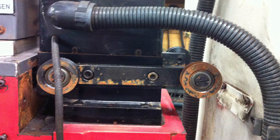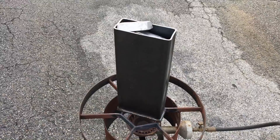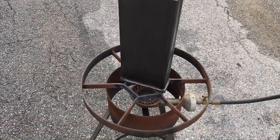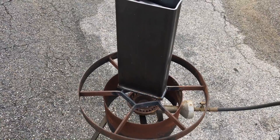Now the pulleys are in place that the chains are supposed to ride over, so that's still there. I did a bit of research and determined that the original counterweight was supposed to weigh about 45 pounds, and measuring on the mill I determined that I could fit a piece of tube steel in there about 2 inches by 5 inches, 12 inches long, capped off one end, and then I bought about 40 pounds of lead weight, took the whole thing outside, put it on a propane burner, and proceeded to melt the lead down into the tube.